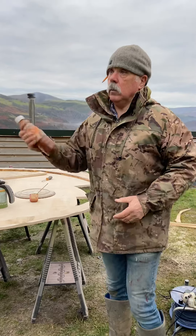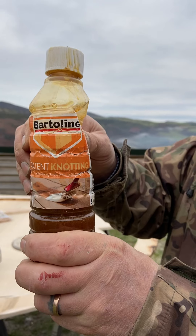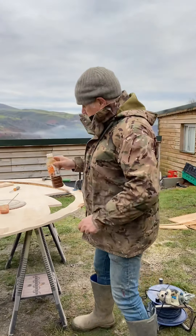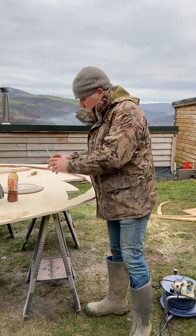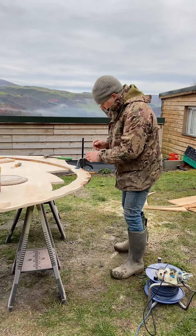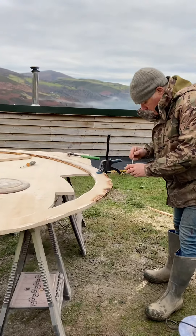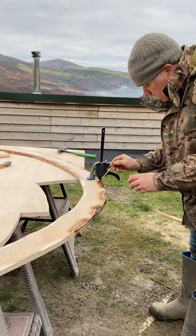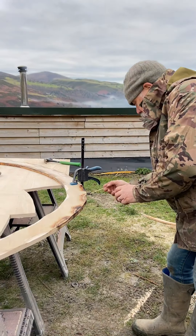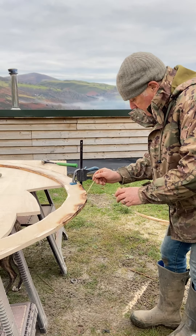This stuff — that saves everybody saying 'What are you using, Chris?' The whole idea of this stuff is for painting on knots, and it stops them from bleeding, stops the resin from coming out of them. What this does is seal it up, and you don't need to put much on. I've given them a fine sanding as well on these chamfers.